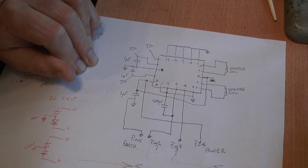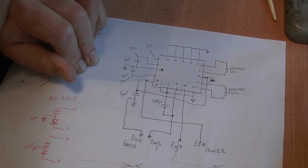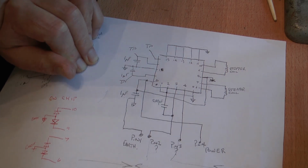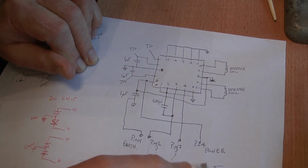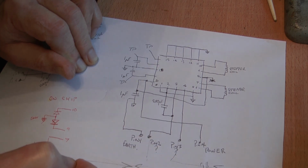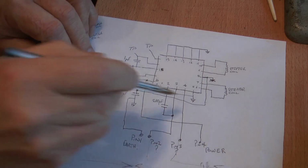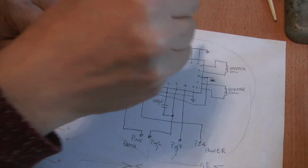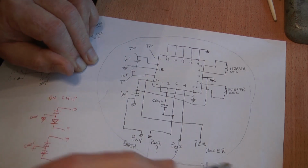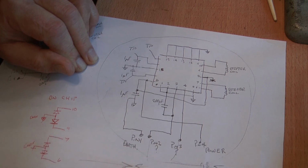Now, where do you go from here? He had 3 of them replaced in the vehicle, and why did they fail? Well, if you get a break in the transmission line, you're not going to get a signal to any of them. And could it be that all these devices are absolutely A-OK, and that the fault lay in the connectors along the, as I say, the transmission line?